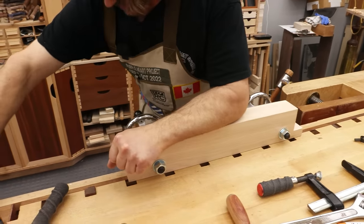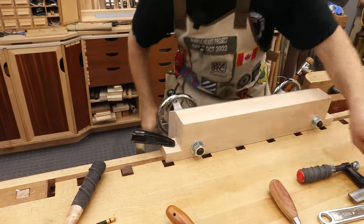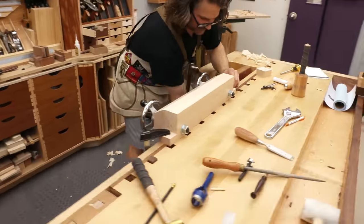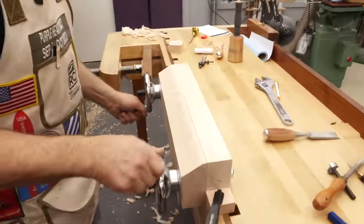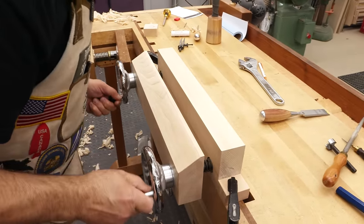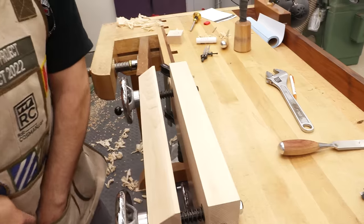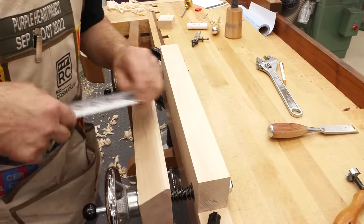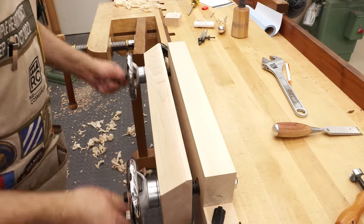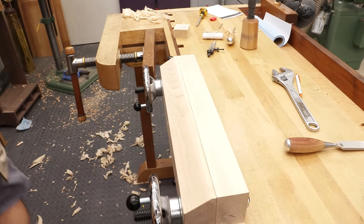Okay, put that on so it comes up flush. Put these on an angle just to keep them out of your way. Okay, now we're going to flush that up, but that's why I didn't plane the top beforehand. Yeah, and that gives you your springs with that much of the rod sticking out. The springs will push it back, so you've got 1 5/8, which is probably more than you'll ever need. It works nice and smooth. And that's sitting down below. Now, plane that off.